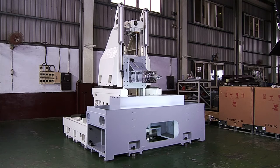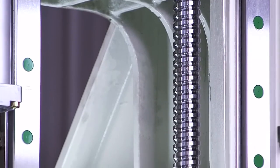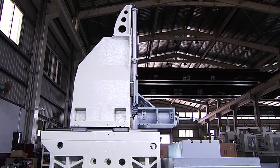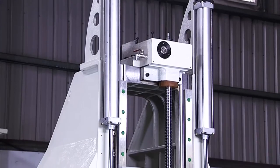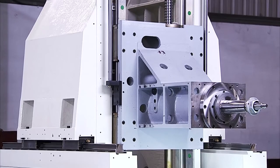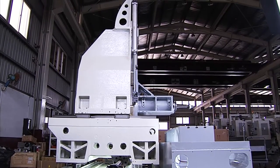All of the FMG series machines share a common three-axis travelling column design, which incorporates a unique high-waist column support to significantly increase rigidity. The travelling column design features high-quality heavy-duty linear guideways, a Tsubaki Class II 50mm diameter ball screw, and even a pneumatic counterweight balance for smooth movement and excellent positional accuracy. With the travelling column design, table load can be increased without impacting grinding accuracy.